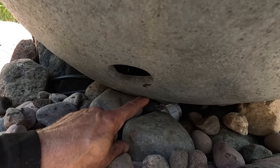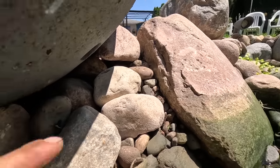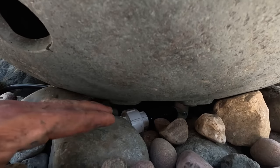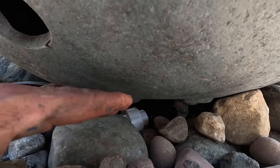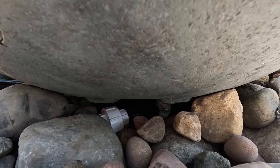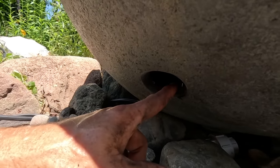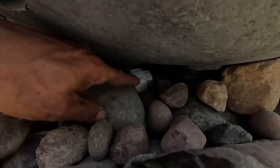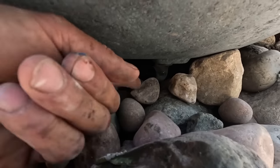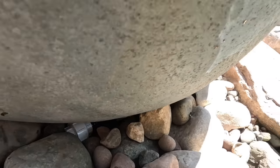The way I established where water level was is I took the algae line and marked it on a series of rocks - you can see where that green line is. That comes right to about there, so you can see the feet of this bowl are going to be just below water. I like to have this thing nestled under the water but the components don't allow me to sink it any further down. Just make sure you don't set it too deep and end up frying all the internal guts on this fire bowl. Also make sure these air holes are out of water in case of any gas build-up so it has an area to escape. This is that one inch flex coming from a two inch trunk line - I've got a union there for easy future swaps - and then it elbows up into that three quarter threaded fitting, reducing down from one inch to three quarters, which is more than enough water for this bowl.